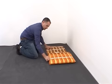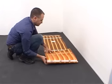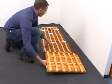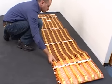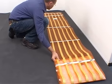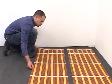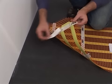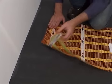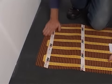Roll out the heating mats on top of the insulation material with the heating ribbon facing down and the fiberglass netting facing up. Place the mats so that the cold leads are closest to the connection box, leaving a 4 inch (10 centimeter) gap between the wall and the heating mats, and a further 2 inch (5 centimeter) gap between each mat. Using the double-sided adhesive tape on each mat, stretch the mats and secure them to the floor. Make sure each mat is completely flat.